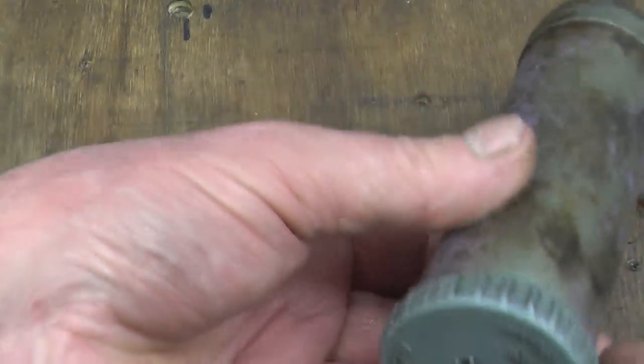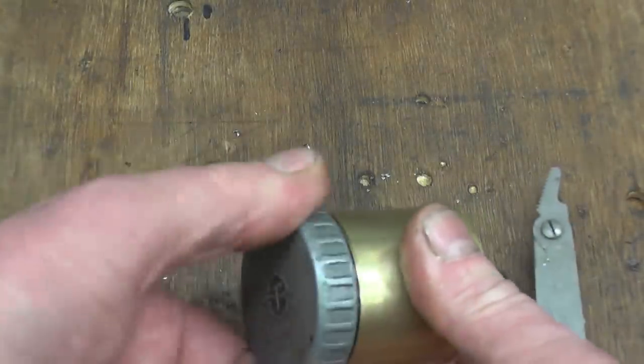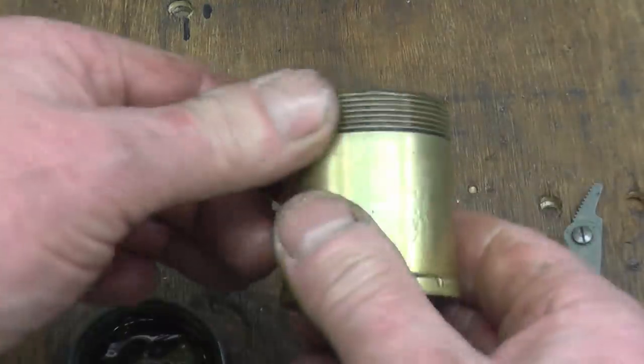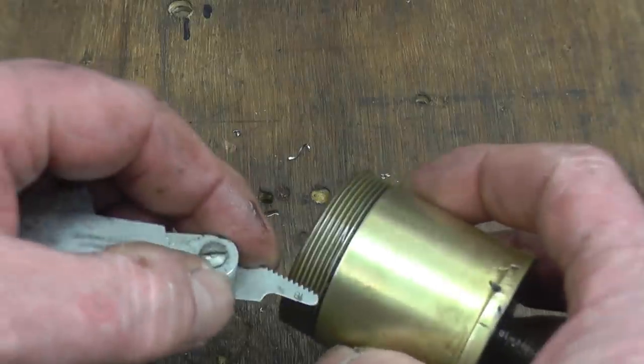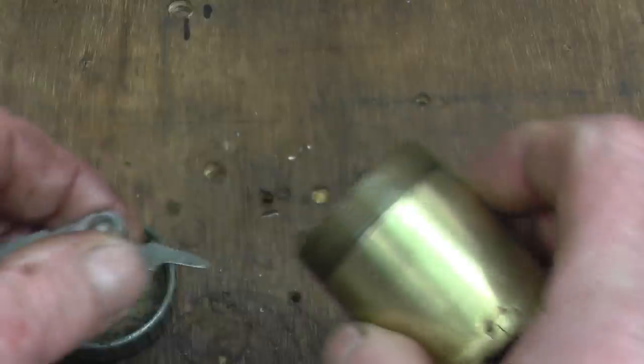And so that's a grease gun with exactly the same cap on. Now what the lad wants me to do is make them two new brass caps. I've measured the thread, it's 18 TPI. I can cut the 18 TPI thread, no problem at all.